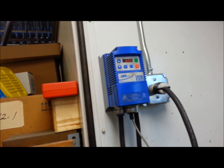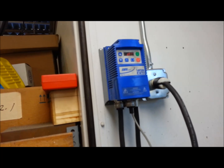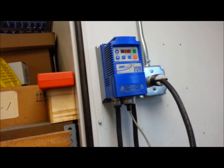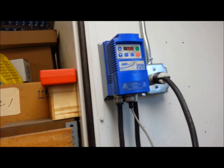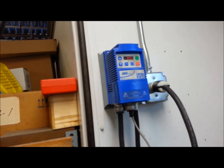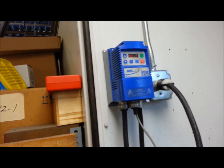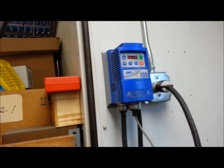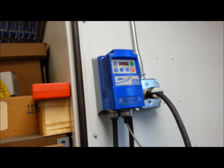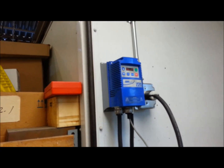Now if I take this switch and cram it all the way through stop and all the way over to reverse, it decelerates, goes to zero, and then ramps back up. It's not going to give a forward or reverse run command until the motor has come to a complete stop. The unit is smart enough to turn itself off and come all the way to a stop before applying the run command in the opposite direction. That's programmable and very easily done, so you can be aggressive with your switches without worry about reversing polarity to your motor.